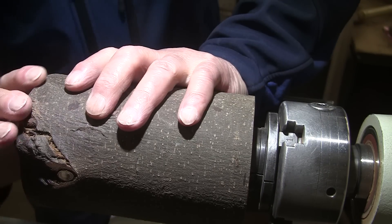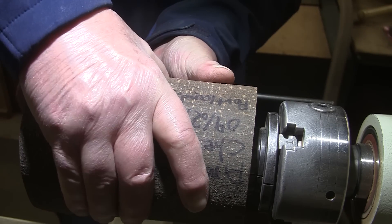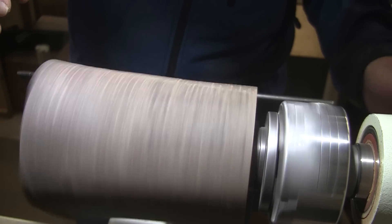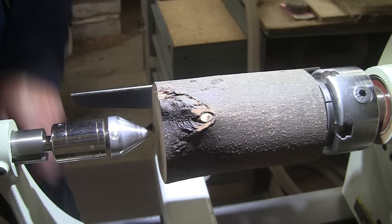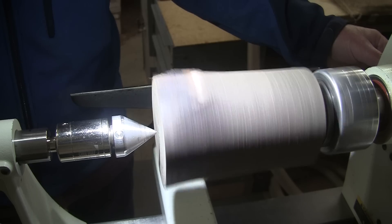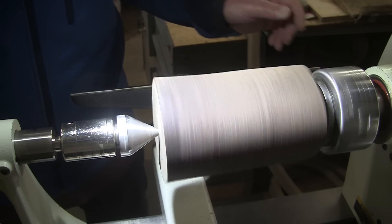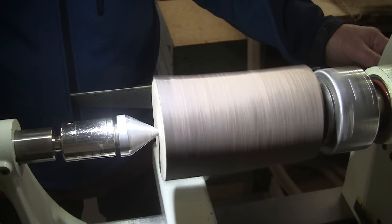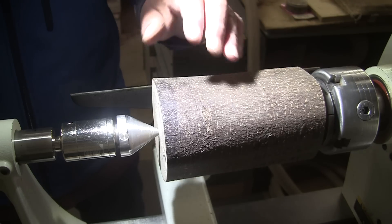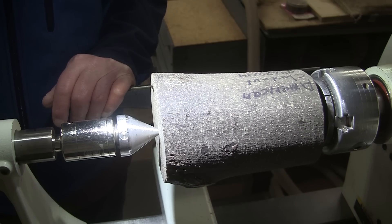It's not always a good idea to use a woodworm screw on end grain, but this looks like pretty sound material and I feel good about it. I'll bring up my tailstock. This is just gonna be a simple, classic weed pot shape — nothing too special about it, but it'll be fun to do. The piece is about six and a half inches tall and about four, four and a quarter inches in diameter. We'll start at about 750 RPM. I'm gonna grab a 5/8 inch bowl gouge after I sharpen it up and we'll get to turning this American Chestnut into a weed pot.